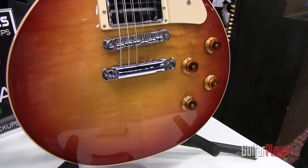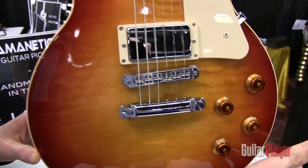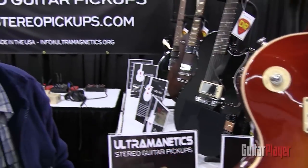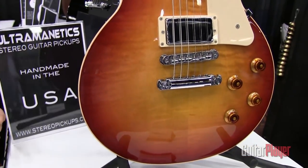This pot here is a channel swapping switch. There's a TRS coming out of the back, so this guitar has not been altered in the physical nature of it — in the wood — in any way, so it's a complete retrofit. The product also works normally with a TS mono scenario, so if you sum it up with that summing switch, it works like your regular guitar.